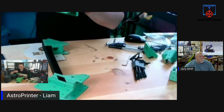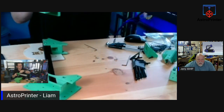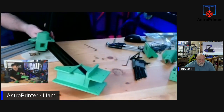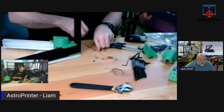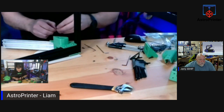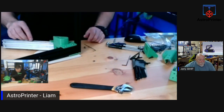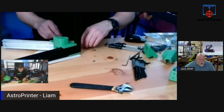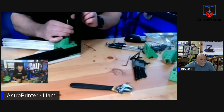I've got to abort my print. Are you having problems? Yeah, it's under extruding. I switched back filament and it's starting to feel spongy. So up the temperature. I'm at 250 already. Okay, well, I've seen some PETGs that require really high temps. It was printing fine, and then I switched over to eSun to fill in the gap for a slightly different color change, and now I went back to what I had in it. It's the part that the drawer goes into, so I'll have to stop it once I get the other roll of filament. Just do it in PLA. Well, I've already got it like 8 inches tall. It's a ton of filament already. All right, I can just glue it. I can reprint it and glue it together. It's not structural, that's why I did mine with PLA.